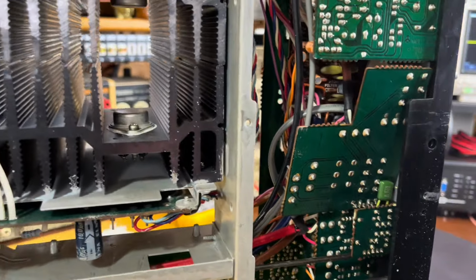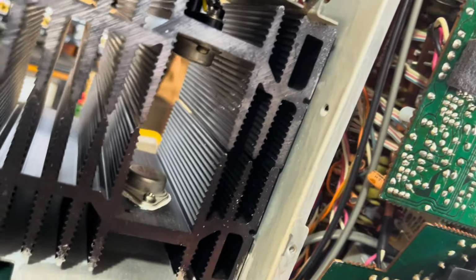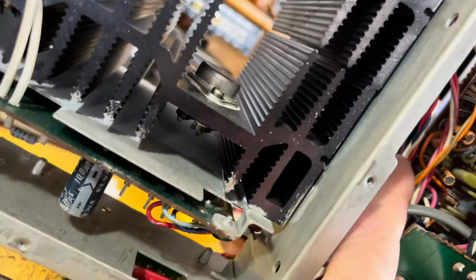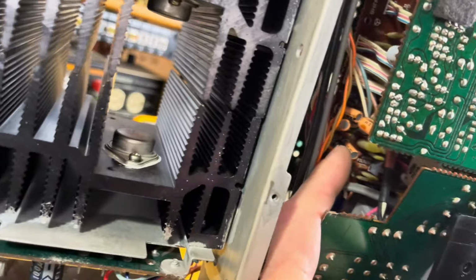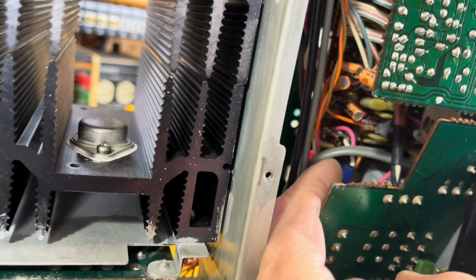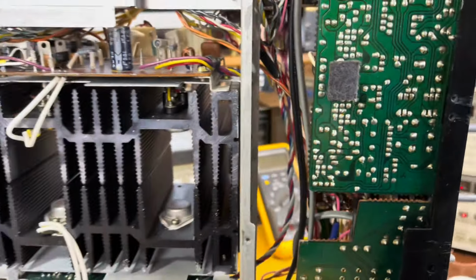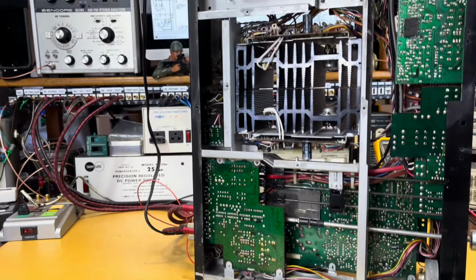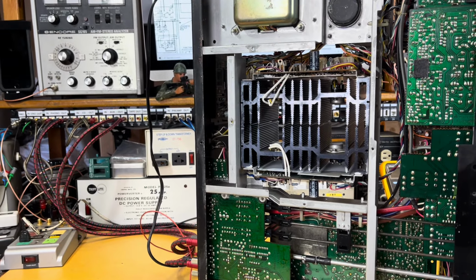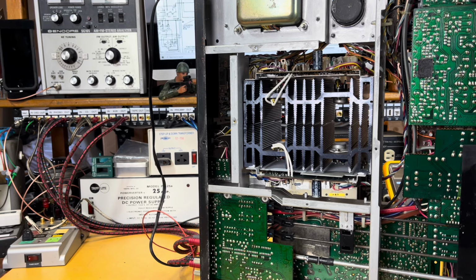You can see if you pull enough things out of your way, like this volume control board, you can kind of see where those transistors are back under there. Let me see if I'm even aiming. There we go. Anyway, they're real fun getting them in upside down. That's what it took. That's what solved that problem. The popping, crackling intermittently. I was getting excessive voltage on the outputs to my speakers, which is not good. And we get all that fixed.